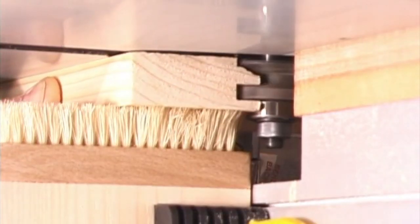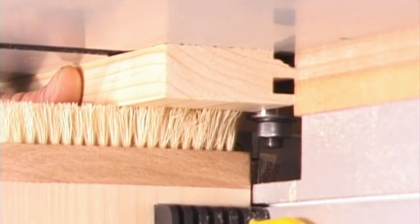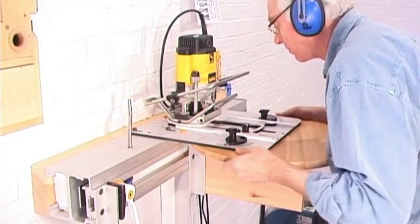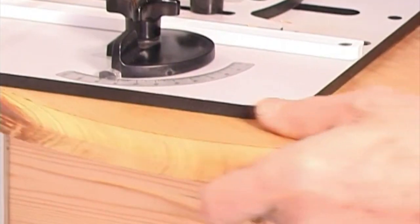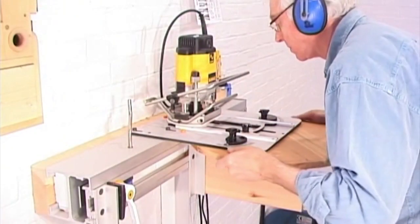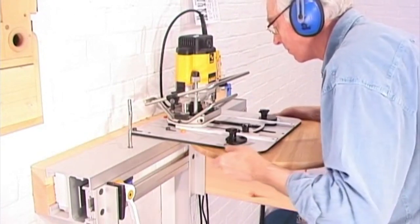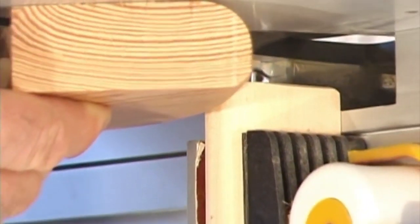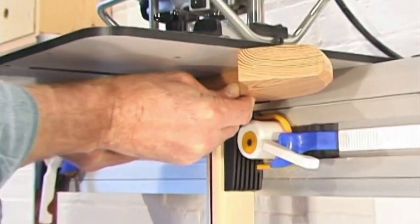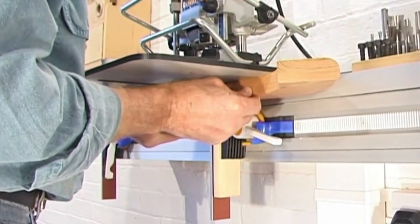Having the cam clamp directly under the cutter has other advantages. A board is set with a sharp pin, allowing you to spin a circle. This profiles a round tabletop for a spindle table. And there's more. Place a rounded board exactly under the cutter and you have a setup for pin routing. Here we're making the spindle table legs.